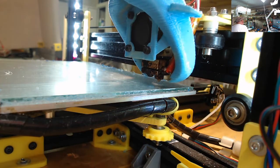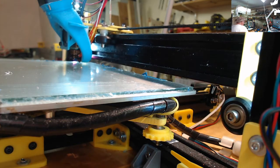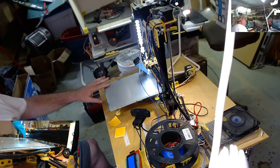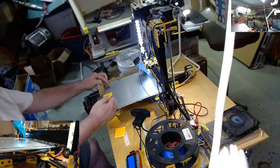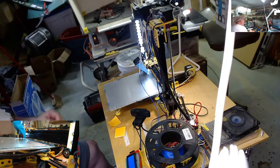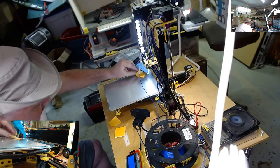That's pretty good. Because what's going to happen is, because I started here, I made sure that was the right distance. And I go over here to do that's right distance. But the pivot point is back here, and I measured here. So as I change this distance on this side, it's going to change that one slightly. Won't be much because the angle is very long, but it still changes it. So what you want to do is get these things as close as you can.